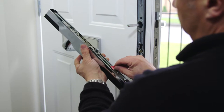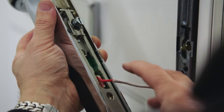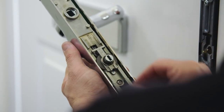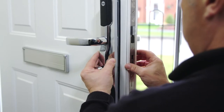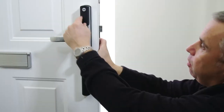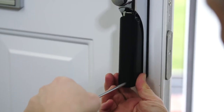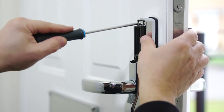Take the cable and push it into the slot in the back of the internal handle, lining up the two red sides of the connector. Make sure the arrows on the tail bar housing are pointing up. Mount the internal handle onto the door over the spindle and tail bar. Please note that the thumb turn should not be moved until the installation is complete. Remove the radio and battery covers. Tighten all the screws in place, ensuring the handle stays aligned.